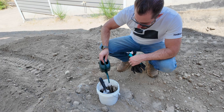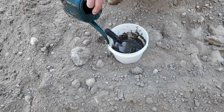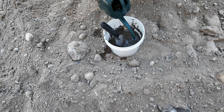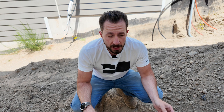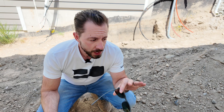So because this has cement in there, I'm going to put the rest of the water in just to try to keep it from setting. Of course it is hydraulic cement, so I don't know how well this is going to work, but I'll end up going down the street and scraping this off and cleaning it. Just a very simple, pretty fast video — nice to have Ethan with me today. When it comes to building science, it's easy to forget about things that are below grade, but you do not want water to penetrate in. We spend a lot of time thinking about air leaks, water vapor, all of that kind of stuff, but liquid water is what will cause you to have problems with your homeowner in the future. So make sure you're thinking about your penetrations, not just on the walls, but also through the foundation.